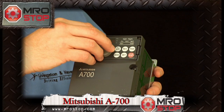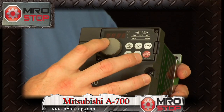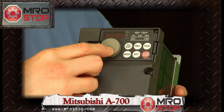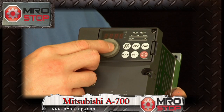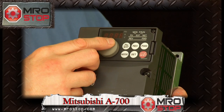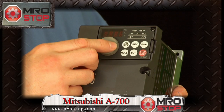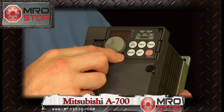The parameter unit, as I said before, is removable. You have the thumb wheel switch for the parameter unit. If you don't want to parameterize through the USB, you can utilize the parameter unit. You rotate the thumb wheel switch to advance or retard through the various parameters, click it to access a parameter, and then change the parameter value with the thumb wheel switch as well — none of those clunky up-down buttons anymore.